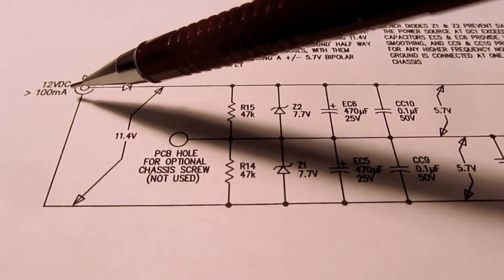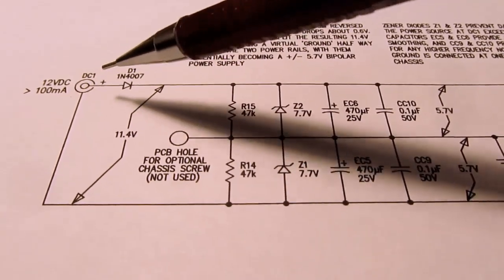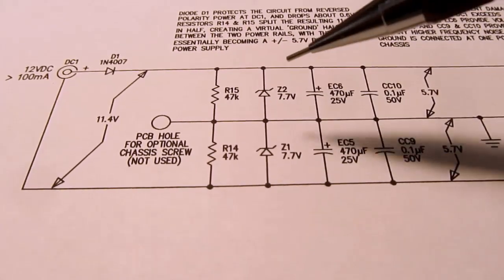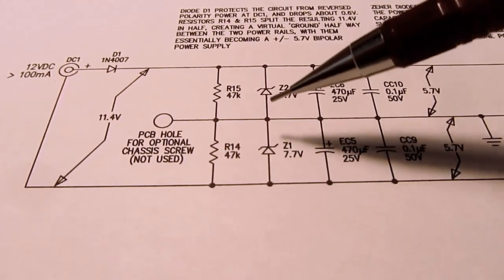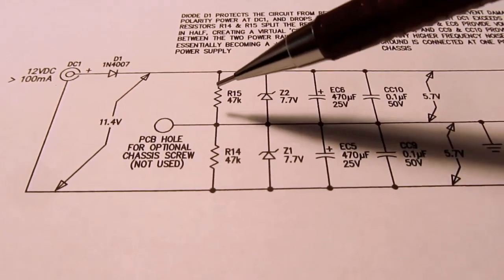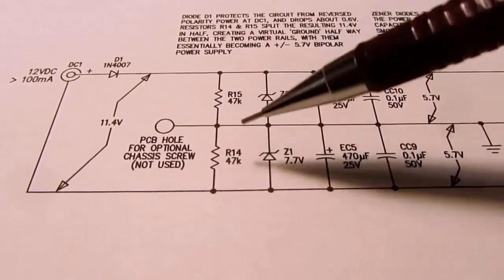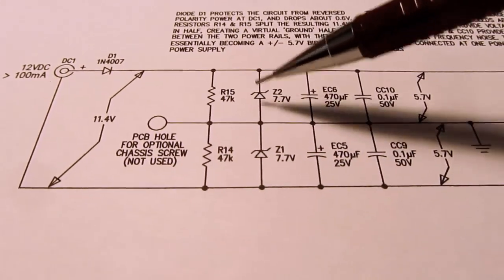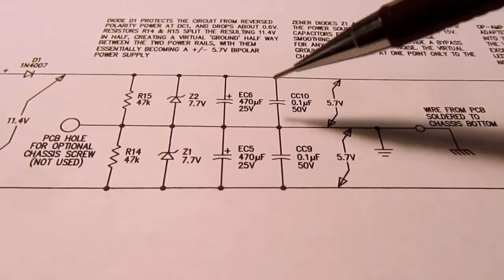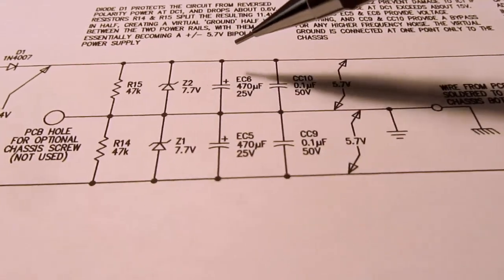than the one that's supposed to be provided with it, and it's putting out, you know, 16 volts or something. In that case, these Zeners would conduct, and they would prevent the voltage from going too high. The other thing that could happen is possibly something could be wrong with these resistors, but anyway, these are clearly here to prevent voltages above a certain level from reaching the op amp. That's the only thing that cares.